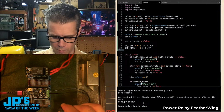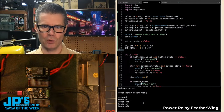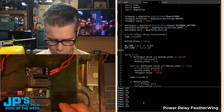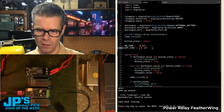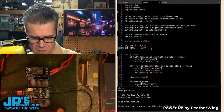I have a little button here, a little switch. When I press it, it will start opening and closing that relay, which in turn opens and closes my solenoid because it's sending the full 12 volts through there. And I can turn that back off for just 0.025 seconds and then dwell in a pause mode for just 0.07 seconds. So it'll be pretty fast.